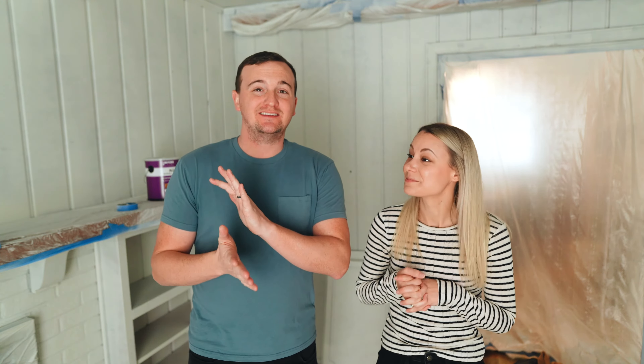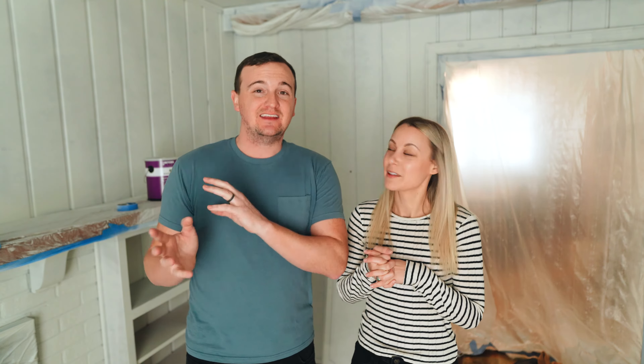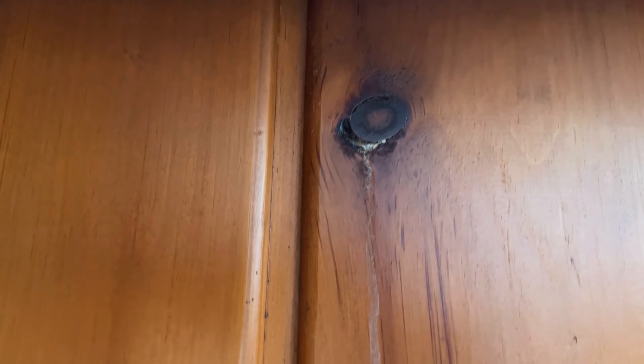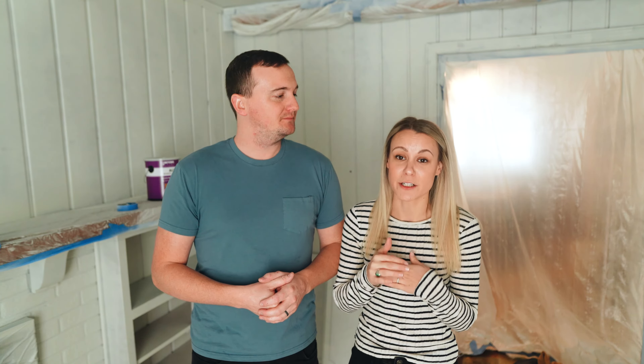It's the next day now and our oil-based primer is completely dry. It did a good job covering up all those knots and some of those oil stains and tannins that would have soaked through our paint. Some of the knots even have sap dripping down from them because this is real pine paneling. So if you are painting anything that has a stain on it, make sure you are using oil-based primer first because that may soak through your water-based paint.